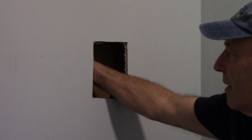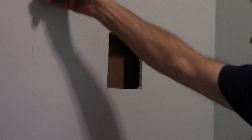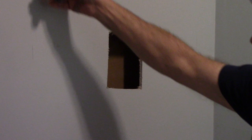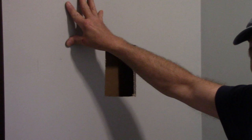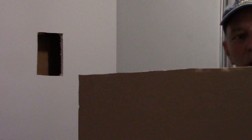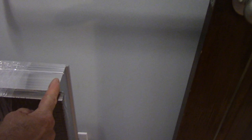Now we're going to verify that the stud is there — and it's right there. I can feel it here and I can feel it here. So we know the studs are right there. I'm going to take my utility knife and I'm going to cut straight down along here to remove this part of the sheetrock. I'm not going to cut it exactly the size of the outside part of the medicine cabinet, because you see the inside part here — this is the outside and this is the inside, this is slightly smaller. So what we want to do is cut it about three quarters of an inch to an inch on either side, and we can always cut it later to the exact dimension that we need.